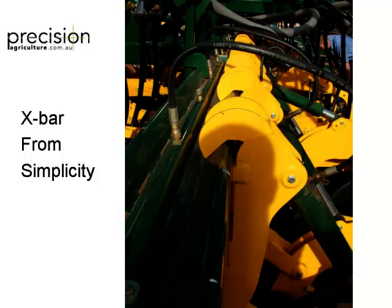It's a bloody brilliant idea, and it's got heaps of strength. He's done 12-metre bar like that. You can get it folding if you wanted. Obviously on here they run an oil line along the top there as well, but basically everything, like your distributor heads, are all on that same pattern. There it is there. So he just clamps everything to each side of the bar, and you've got complete flexibility about your row spacing then.